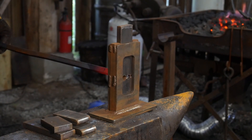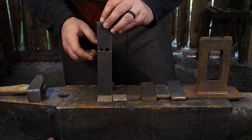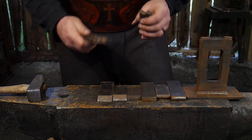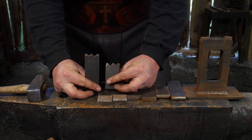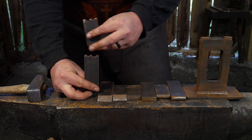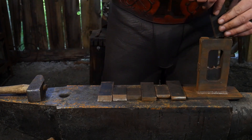By tack welding first and then drilling, I get a properly sized tenon and not something that's oval or cat-eyed — because if you remove material from a circle, you don't have a circle anymore, you have an ellipse. So I cut the piece, re-tack weld it together, then drill all the way through both halves, and that gives me a proper tenon die. This is for rounding up tenons and bar stock, and you can use it in many applications where you need a top and bottom swedge tool — even for making tiny rivets. It is a very handy tool to have in the shop.